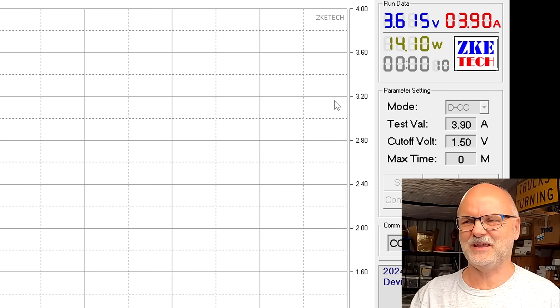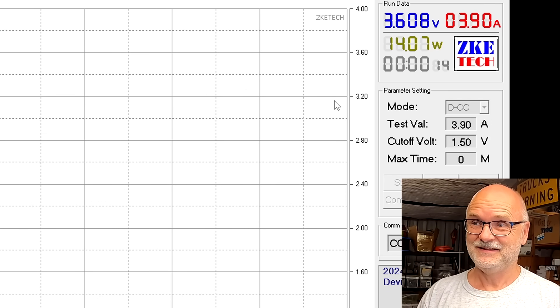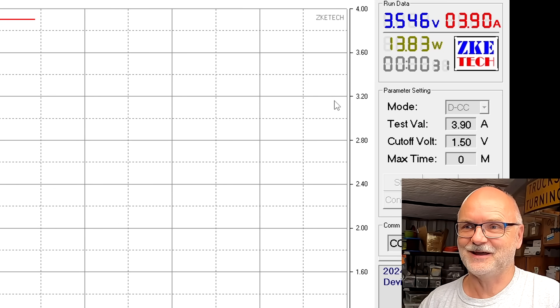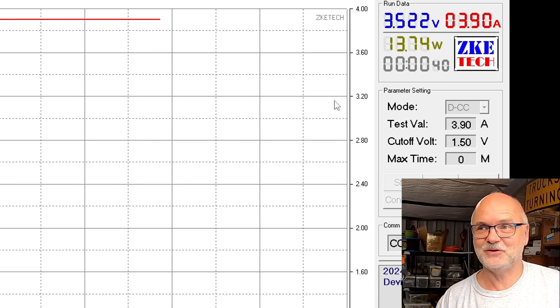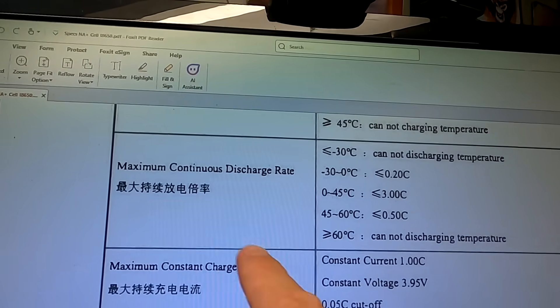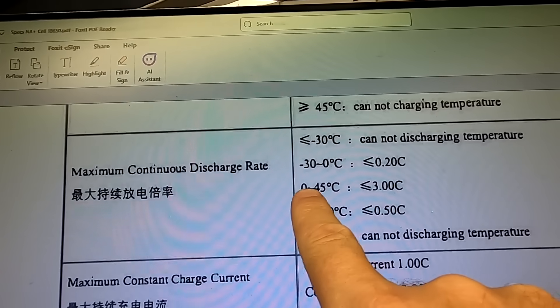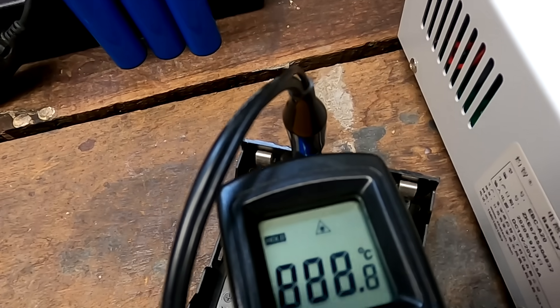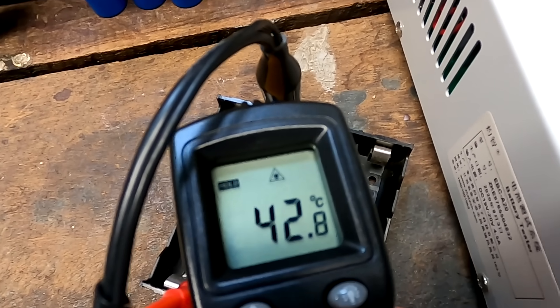It should be done within 20 minutes maximum — that is insane. Temperature measuring 28 degrees Celsius. Let's see how warm this battery gets with a 3C discharge. We've got a bit of a situation: still discharging with 3C and according to the specifications, the maximum continuous discharge rate is 3C up to 45 degrees Celsius — and we are already at 43 degrees.